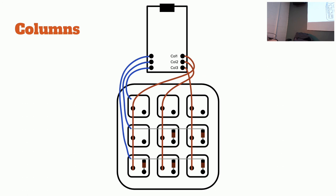Yeah. And now what would help you is to try going through and snaking it. So go on this side and then on this side, and that'll give you some connection there. So it'll kind of hold it in place. Yeah, so strip it here, wrap it around a little, and then you'll have a good connection, and then solder those together.